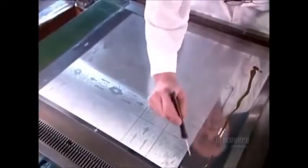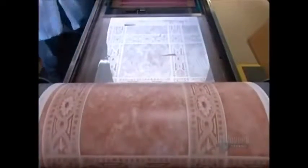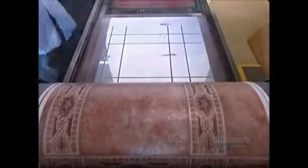A graphic designer creates the artwork by computer, then with a colorist experiments with dozens of color combinations before deciding on which ones to use. The computer breaks down the final design by color in order to produce an engraved plate for each one. Then they test out the design on a piece of foam, printing one color after another until the design is complete.